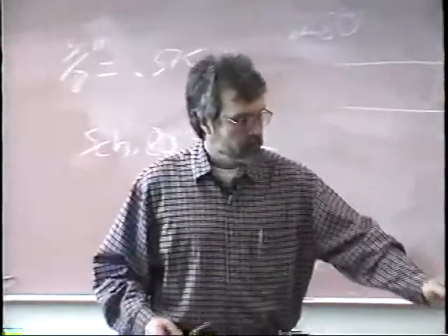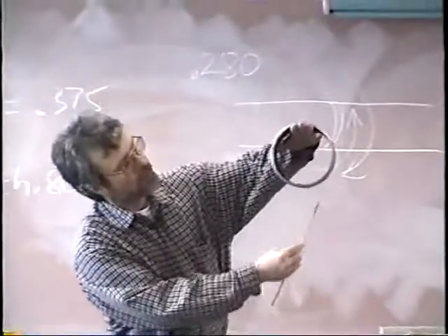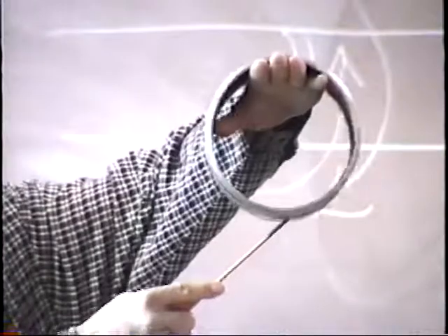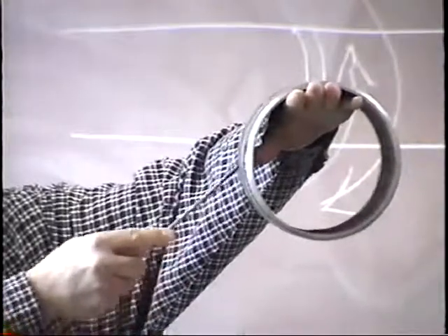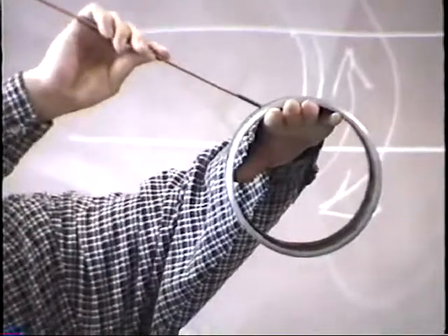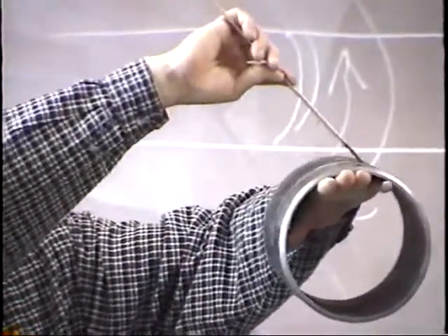You're going to start down here in your 4G overhead position. If you lock your wrist and use a slight angle and then come across, it will automatically transition to the 3G or vertical up push. Then you want to maintain your push angle all the way up. When you're up here now, you're in the 1G or flat position.